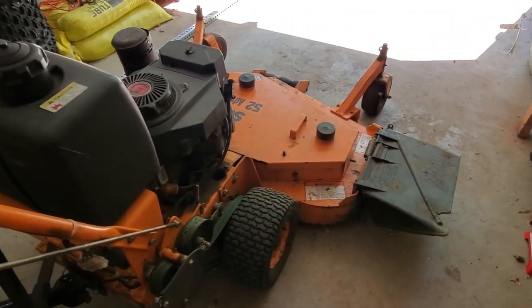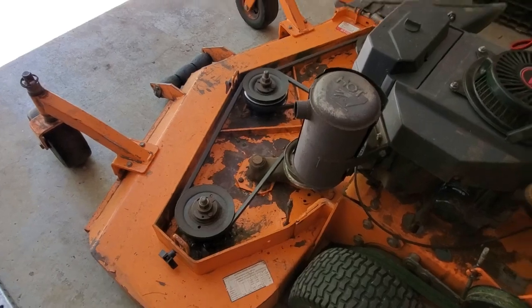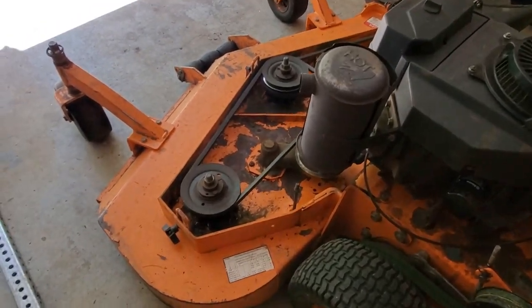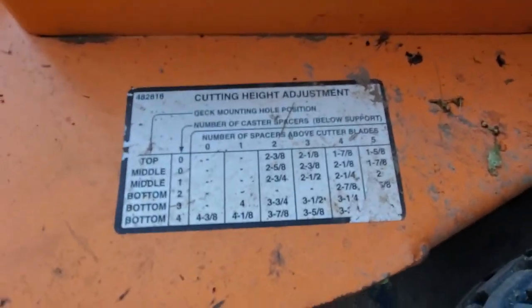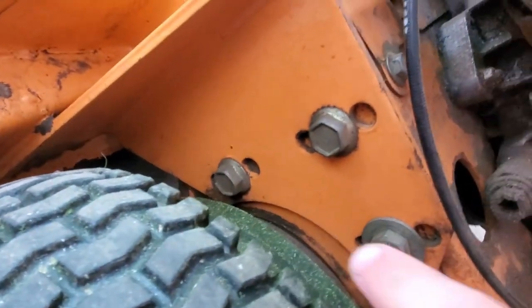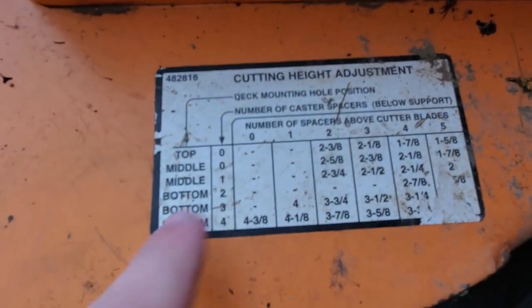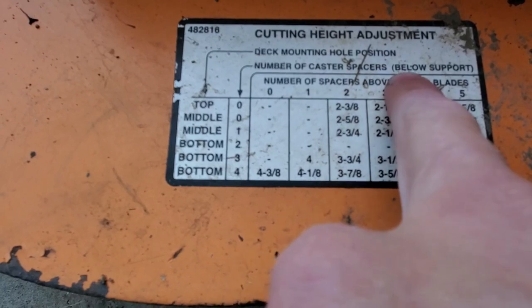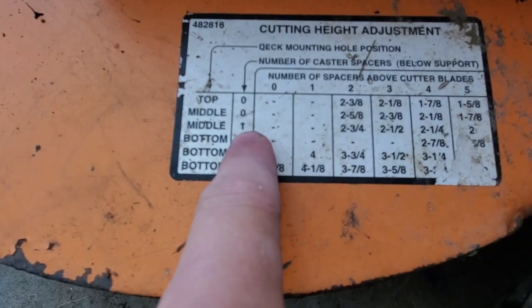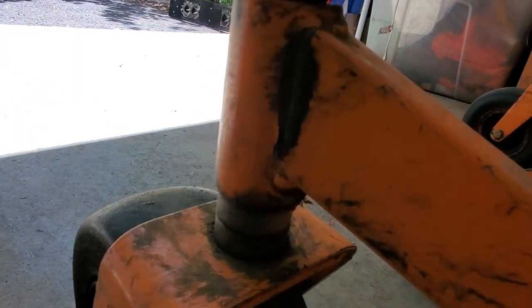First thing I'm going to do is take a look at the deck. I think I already figured out why this thing is cutting terribly. There's a sticker that shows your cutting height adjustments. Right now my deck is in the middle position where it attaches to the engine piece. Following from the middle position, the number of caster spacers below support should be zero or one - you can't have two, but mine has two.